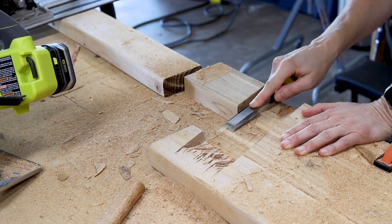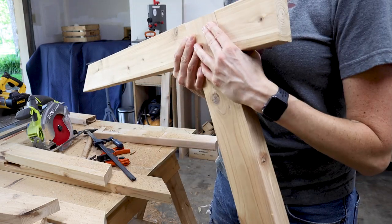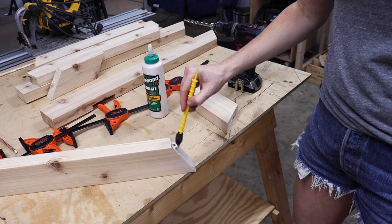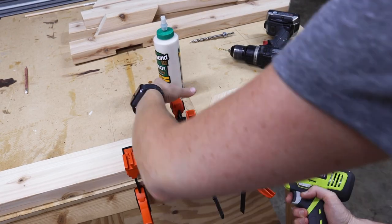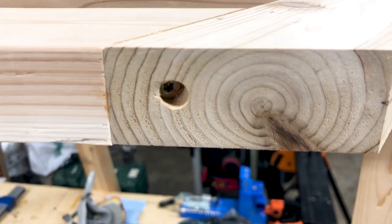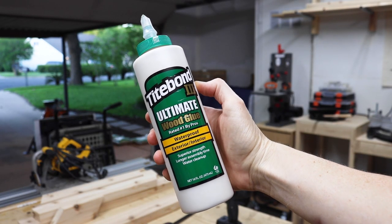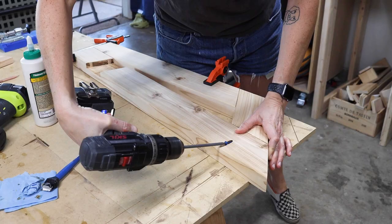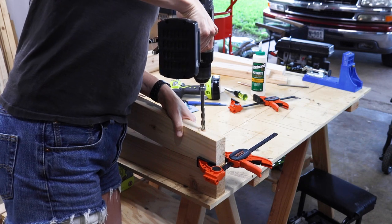You won't be left with a perfectly clean joint but a chisel will help clear any rough spots out. To avoid screws showing on these first two pieces, I'm going to screw them together from the bottom. I glued and clamped the pieces together, then drilled out a recess with a three-eighths bit and screwed the two pieces together. I'm using a waterproof glue since these are outdoor chairs — I've linked the glue and everything else I'm using in the description box below. To join the next two boards I used a pocket hole that will be hidden under the seat slats, and then for the last two pieces I again recessed and screwed in from the bottom.